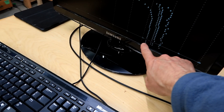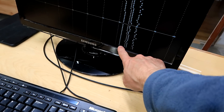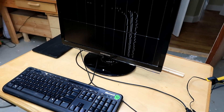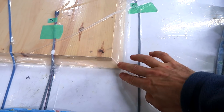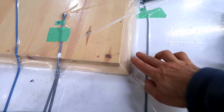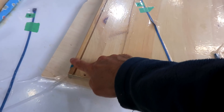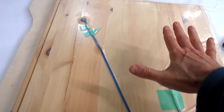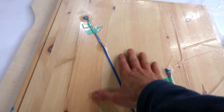Look at that — that's sensor D, and it's now got almost as much vacuum as the other ones. I think what's happening is just because the plastic doesn't go straight into those corners, there's a big vacuum distribution channel around the edges. And since there's no leakage in the middle, it doesn't matter if I don't get very good airflow there. As for controlling leakage around the edges, I could also just tape it and that would solve it for sure.